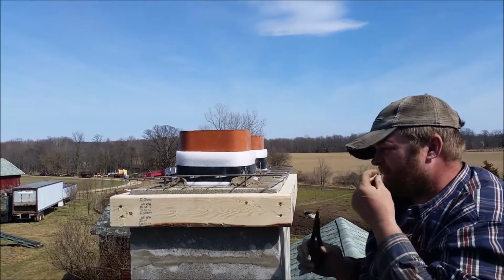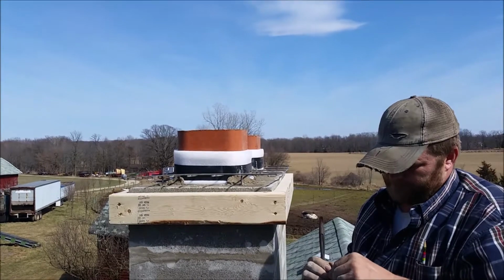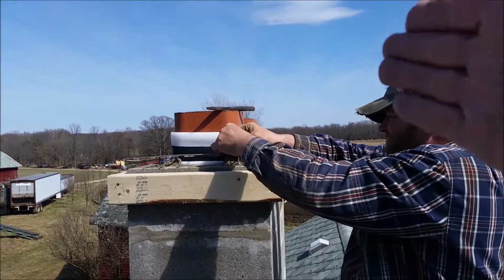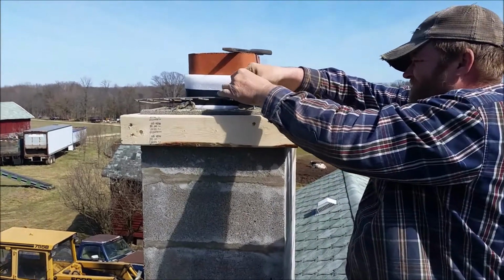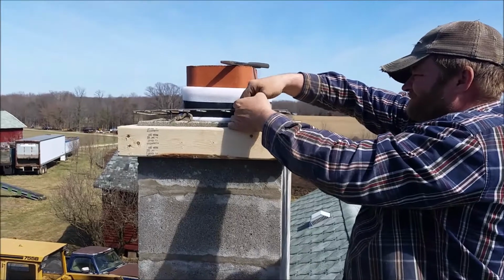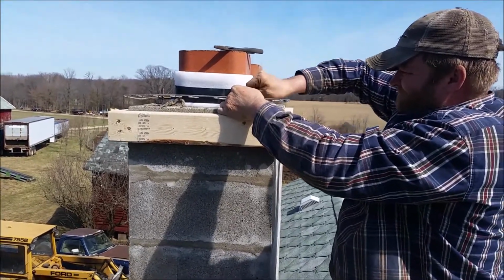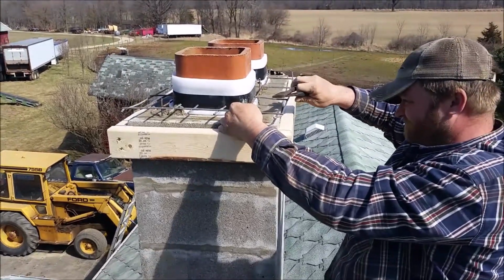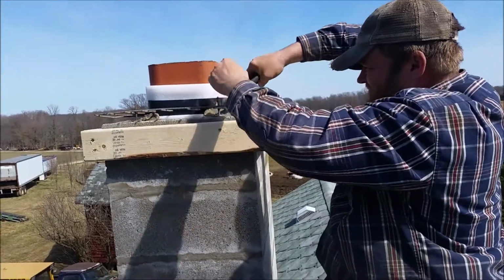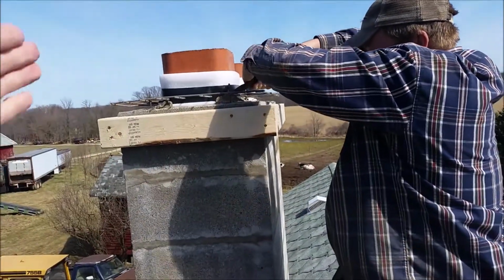The stainless steel chimney cap that we're getting is going to attach to the chimney flues, and because it's a double, you want to make sure that you don't have water, snow, rain running down into your masonry blocks. So he filled all of those holes with concrete, and he put some scrap metal pieces that we had down in there to attach some leftover hog fencing, and that's serving as like a rebar reinforcement. He's going to attach some 2x8s here around the side to build it up.